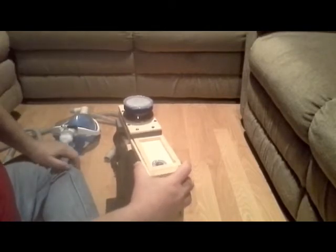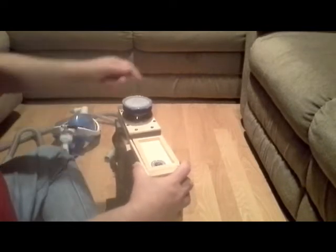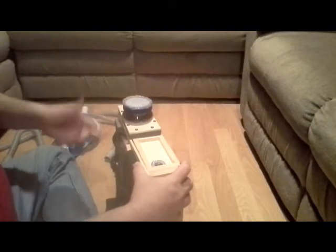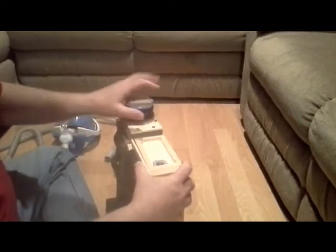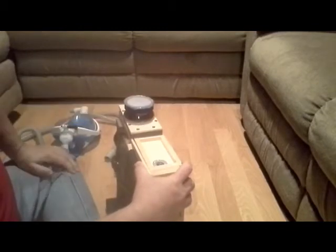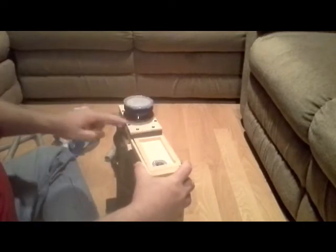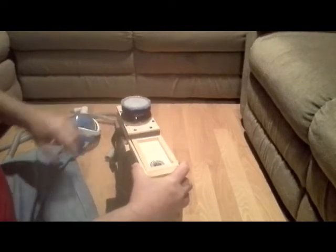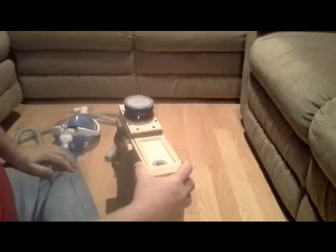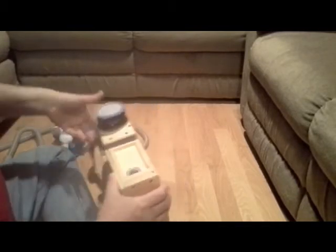You buy your paper, your filter paper like N95 or P100 or HEPA filters, buy it in bulk, cut them to size. Buy your activated carbon, remember it's got to be activated carbon or activated charcoal, whatever we call it, and get that in bulk, and you can make this for a few cents a filter, and you can go out all day with this filter before you have to replace it. And so this was an adapter I make. I'm going to waterproof this so I can even take this off and rinse it off and disinfect it if I have to. But basically this is what's underneath this side if you watch my last video.